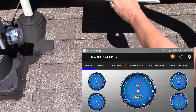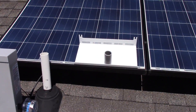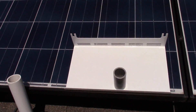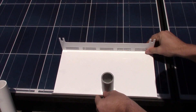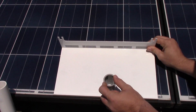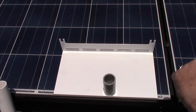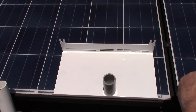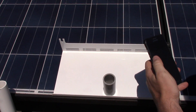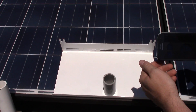I want you guys to see the tilt of the solar panels — let me lift it up so you can see. If the solar panels were tilted this much it would be perfect solar noon, but it's tilted about three degrees off. Three degrees is not going to account for the difference of 800 watts from two weeks ago to today. I'll take a snapshot photo for you right now of what we've got going on — we're making less power than before.